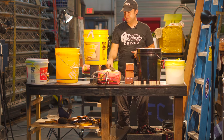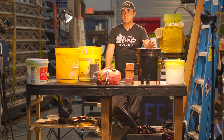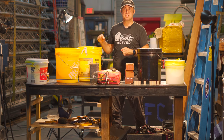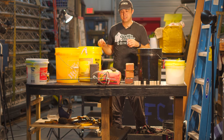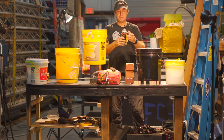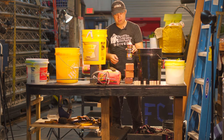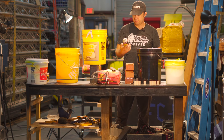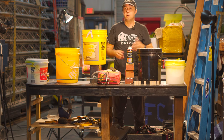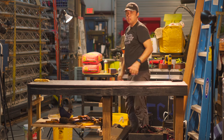Let's get started. When you're gonna mix concrete, you want to make sure everything you're gonna use is available because once you pour everything and start mixing, you have to keep moving — the quick-setting stuff does set quickly. Also, something lubricating — normally I would say WD-40, but I have some lubricant from PB Blaster. You could use canola oil, motor oil, anything slippery. You're gonna coat the inside of the bucket so the concrete does not stick to it once it cures.